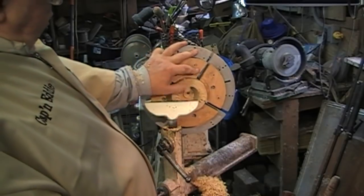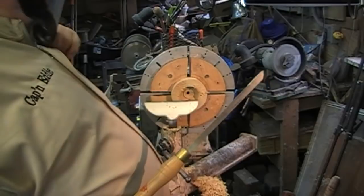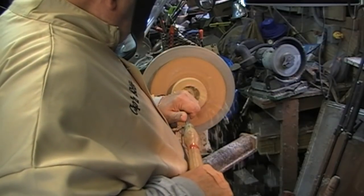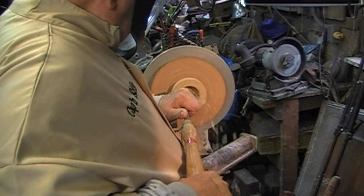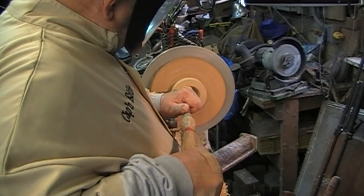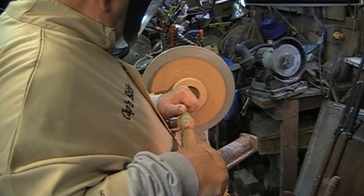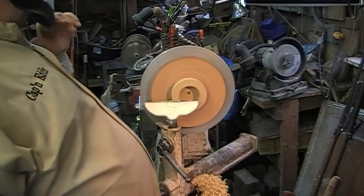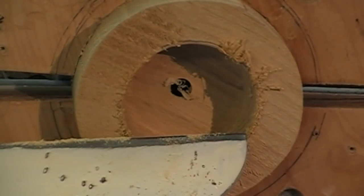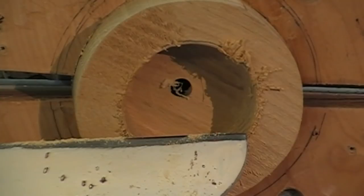All right. We have it trued up here a little bit. Let's get back there and make it 2 3/8 inch deep. Shields up. 2 3/8 inch wide. Shields up. See what it ended up with? I got an eighth of an inch left in there. I'll take care of that, and then I'll be spinning it clear. Shields up, let's go.